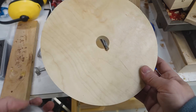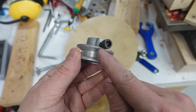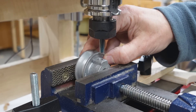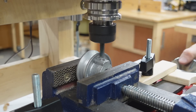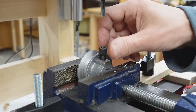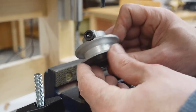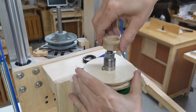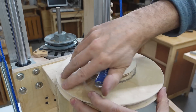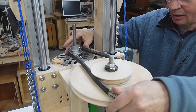Keyway cut. Now it'd be nice to pair this big pulley with a really little one, but I don't have the right set screw for it. This screw works if I can get it a bit deeper, but that means I have to cut a little bit off the rim — and I just happen to have something that looks vaguely like a milling machine to take care of that. After a few passes — not quite far enough, then too short — I get there.